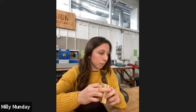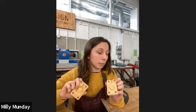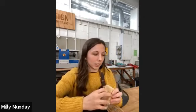It's really good for metal masters. So if your piece of jewelry or your ring, whatever it is, is already in metal, then it's a really good way to make a mold. They're also really durable molds, so they'll last a long time and you'll get a lot of multiples out of them. Separating the two halves is a bit easier than it is with the silicone ones. What we do is we dust a little bit of talcum powder when we're making it. I'll briefly show you. And that helps to separate the two halves easier. So that's a pro.